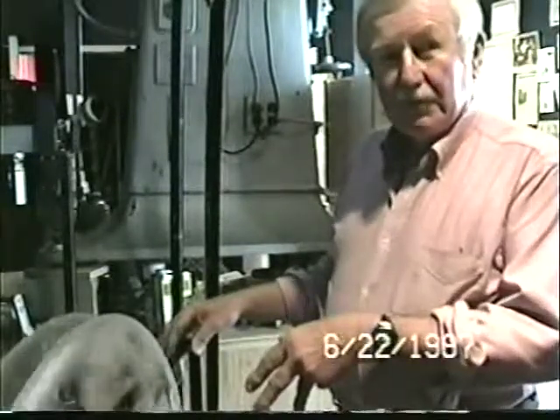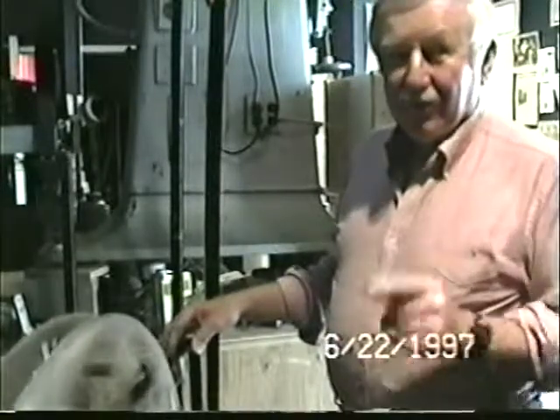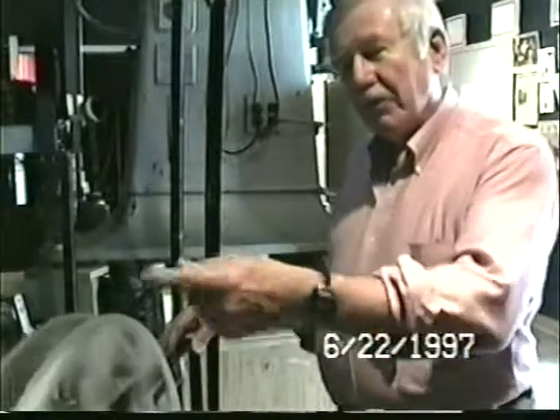At this rewinding machine or playback machine, that reel on there — the film has to come off the top, and that line should be close to you. Now, if you've messed up on rewinding it on the baker and you put the reel on there with it coming off the top and the line's on the back, then you can make up for it — you don't have to rewind — just put a twist in the feed, since you're going with a series of rollers to get into the top of the baker's track.